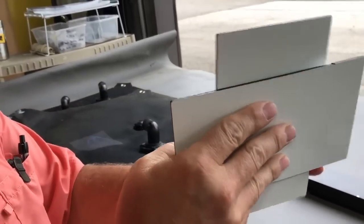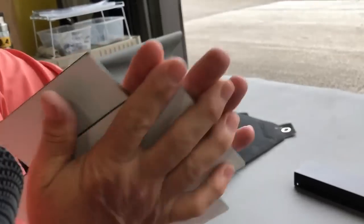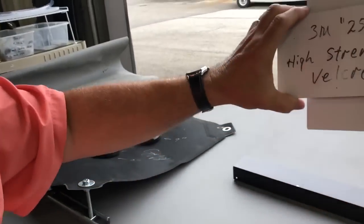That is incredible. Anything we want to stay put, we use the VHB tape and the caulk together because every caulk manufacturer says for strength the caulk has to be a certain mil. I use that mil in VHB tape. You can't push the panel too hard to squish the caulk to paper thin where it doesn't hold anymore. It's optimal in thickness for grab, and you have to cut it apart. You cannot pull it apart.